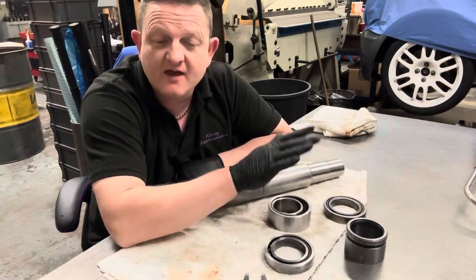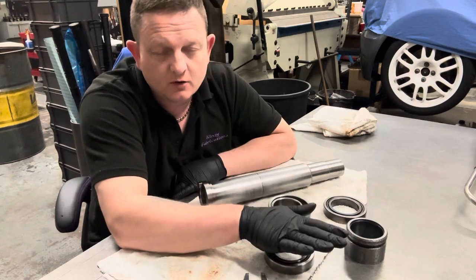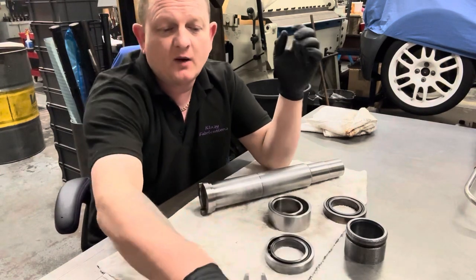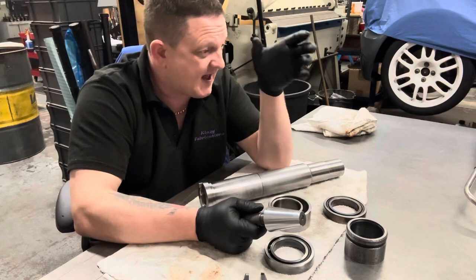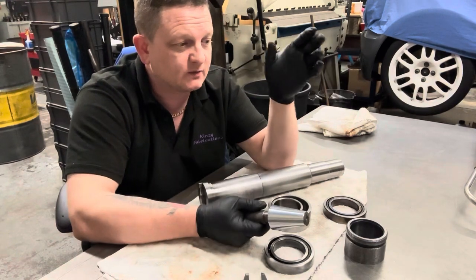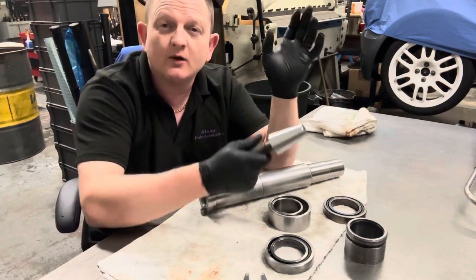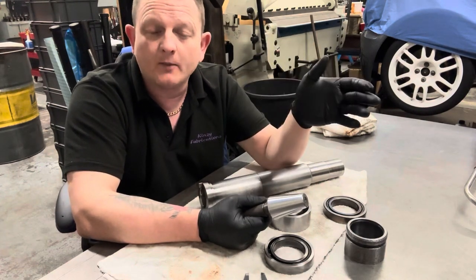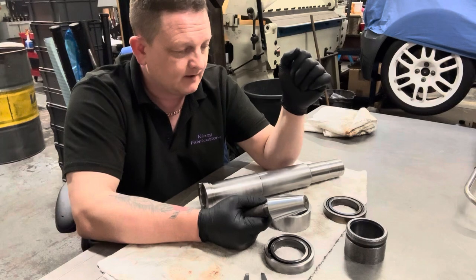So on almost every job, which is annoying but it's doable, I have to run optional stop. And when the tool change comes in, I'll go over there with a copper mallet, and as it tool changes, I'll be standing there and it'll get stuck. And I just ding, and you only have to give it a small tap and then it will release. If I don't do that, it'll alarm out because the tool won't come out.